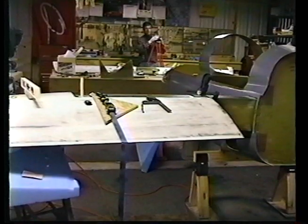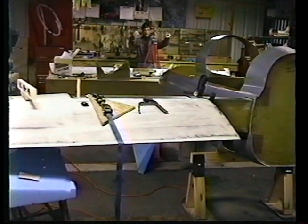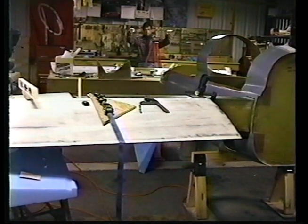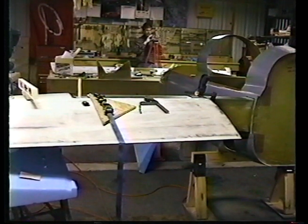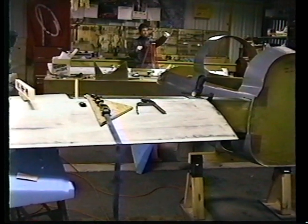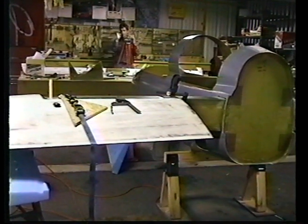We do the same thing with water level. Okay. Standing next to the transit. This has been leveled. We've got two marks on the wall behind the photographer. Those marks were placed with the water level, and they were placed arbitrarily, actually, drawn on the wall. And I shoot those marks with a ruler measuring down from the top of the mark. I substantiate what the distance is down, swing to the other side, and do the same.